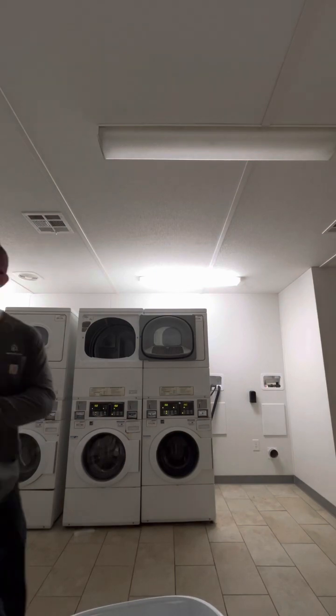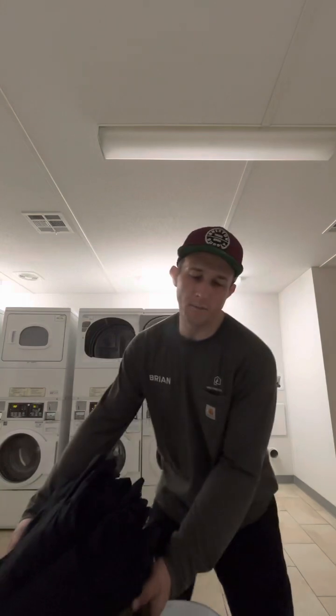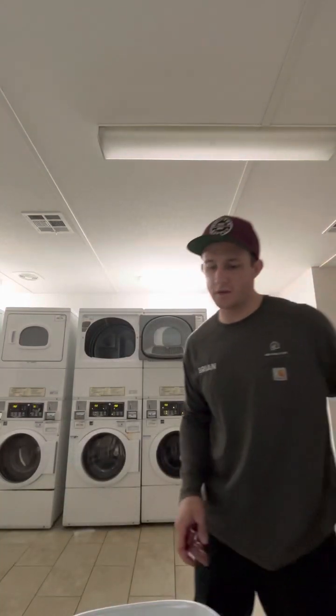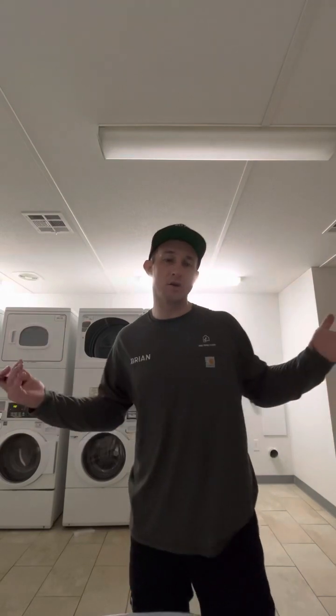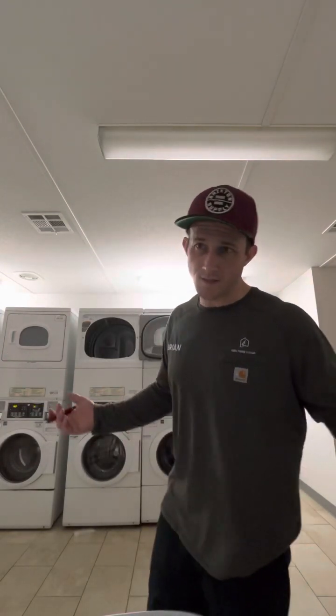When you get that calculation, you can add up your wattage on both sides before you get your amperage. You'll have the wattage, see what your wattage number is. It'll get you real close to the size. If you come up at around 10,000 watts, you're going to need a generator around 10,000 watts, give or take.